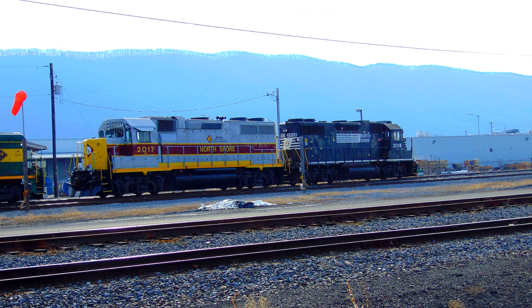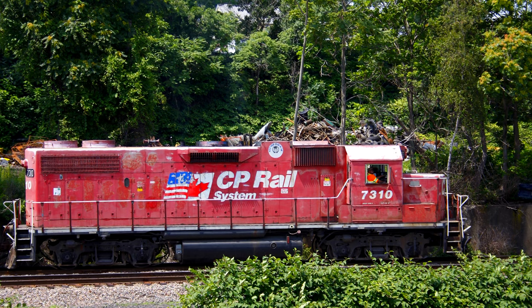For more than 40 years, the GP38-2 has worked mainline freights, locals, switching jobs, yard service, helpers, snow fighting trains, and even hump power. With the unveiling of the -2 line 6 years later, EMD had made some 40 improvements to its modern Jeep. A few of the more major internal changes included a redesigned, non-turbo, 16-cylinder, two-cycle model 645E prime mover and a new solid-state electrical cabinet, which was not only modular in design to aid in quick repairs, but also fully sealed and pressurized in an effort to keep dirt and debris out of the system.